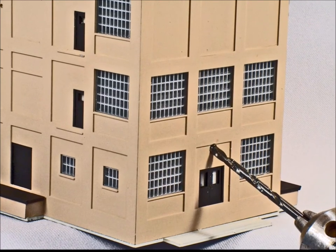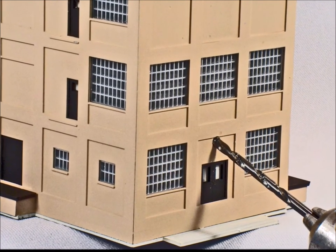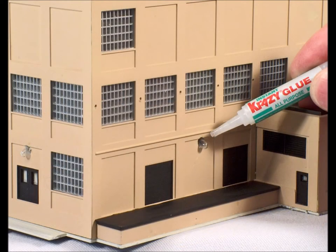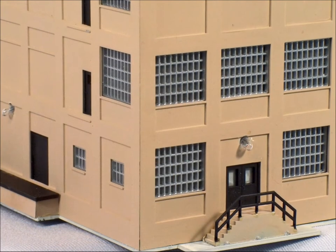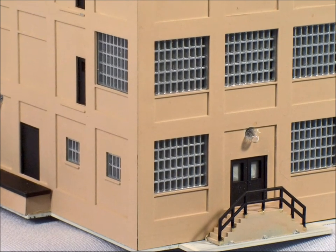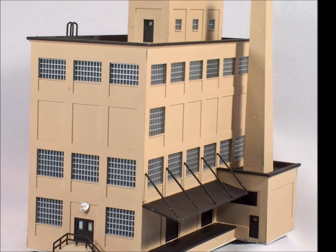Another thing I like to do is add lights over the doors, which means you've got to drill holes and put lights in — so think ahead before you start drilling. If you choose to use incandescent bulbs, make sure to put a resistor in so they're way less intense but still work just fine. They're cheap. Put a little aluminum foil over it so it only shines down.